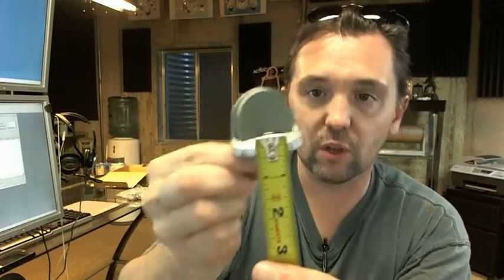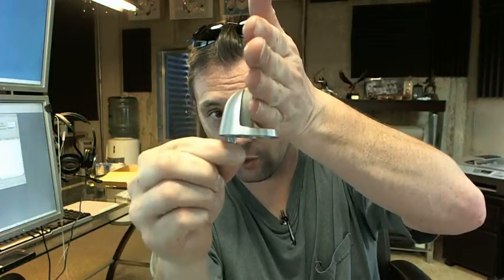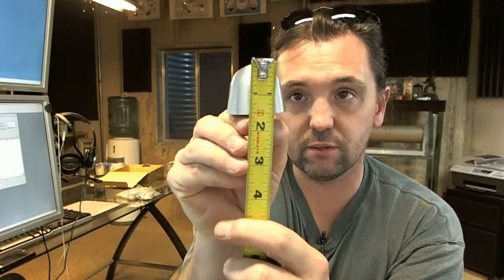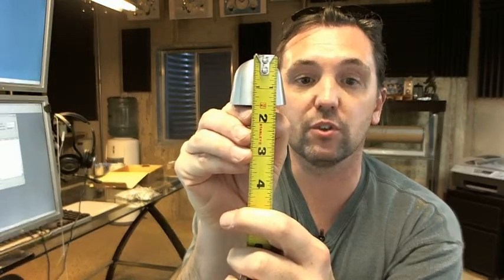The cut sheet link is below this video and it will show you all the dimensions, but just quickly, the lip is quarter inch height and that's going to fit in really most instances where the door undercut is such that it will clear the quarter inch lip. But the overall height at inch and seven sixteenths is such that you'd have to have a real excessive undercut for the door not to be stopped by this universal style stop.